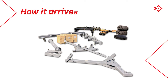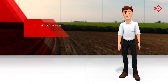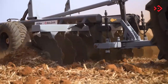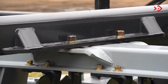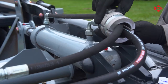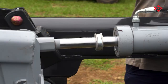See how the harrow arrives and how it should look after you've completed the assembly. Now, let's learn some possibilities of adjustments. The cutting angle can be adjusted according to the need to increase or decrease the depth of the discs during work. This adjustment is made by opening or closing the front and rear frames, which are on the right side of the harrow. The machine leaves the factory with two limit rings that also assist in the control of working depth. To do this, insert or remove these rings from the hydraulic cylinder as needed.